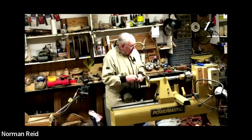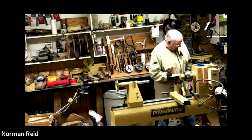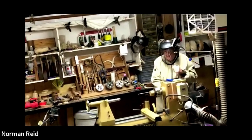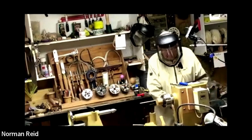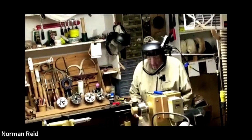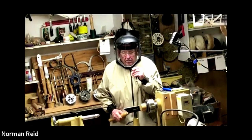Okay, so we've got the wood in here, and it's a little stubby piece. And now we're going to start this thing. Put on my headgear. Can you hear me? Talk now, good. Okay, nothing's happened. So we turn this up. With this size of piece in here, I like to go about 1200 RPM, 1300 RPM.